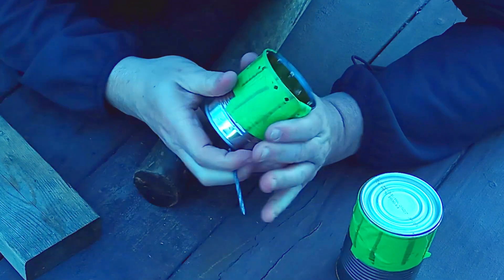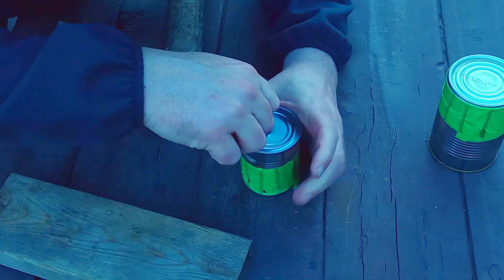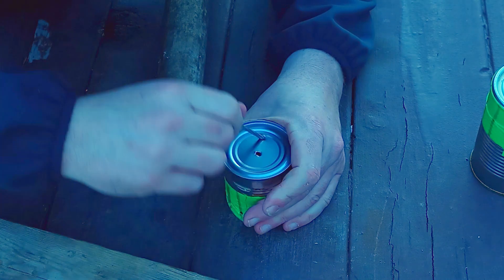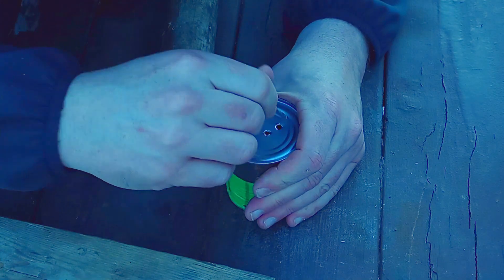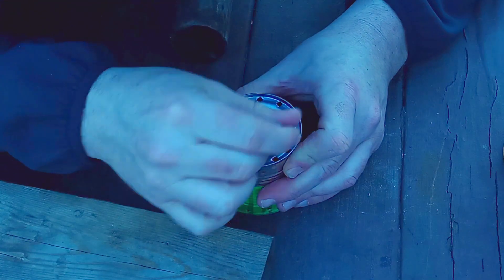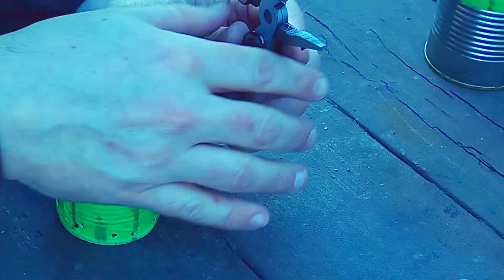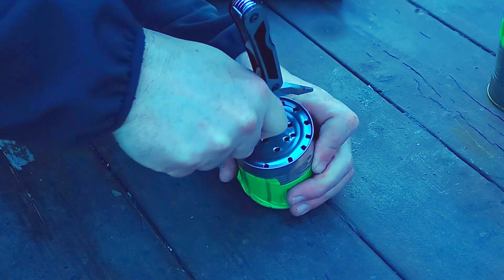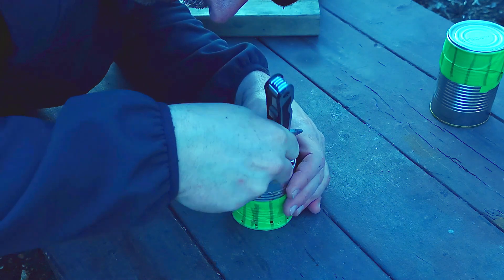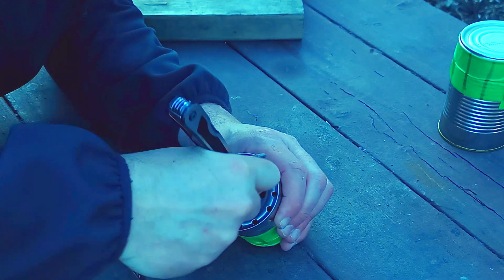Done. A little misshapen, but none the worse for wear. Now we're going to start banging some holes all over the place down here. Bang some holes, bend them up good. I'm going to open a few of those up a little wider with something else, but you need a lot of air — your fire needs a decent amount. This is where if I was using a drill bit I'd be using larger bits, but I'm just going to do it randomly. Get those holes a little bigger. We're going to use the edge of this plier — just get a cornery tip into some of those holes to get them a little bigger. Just work them a little and twist. Take your time here — you don't want to tear out the whole stove, but notice we've got a nice air hole now. Be careful when they're closer together; if you push too hard and force too quickly, you're going to end up taking out the whole bottom of the stove.